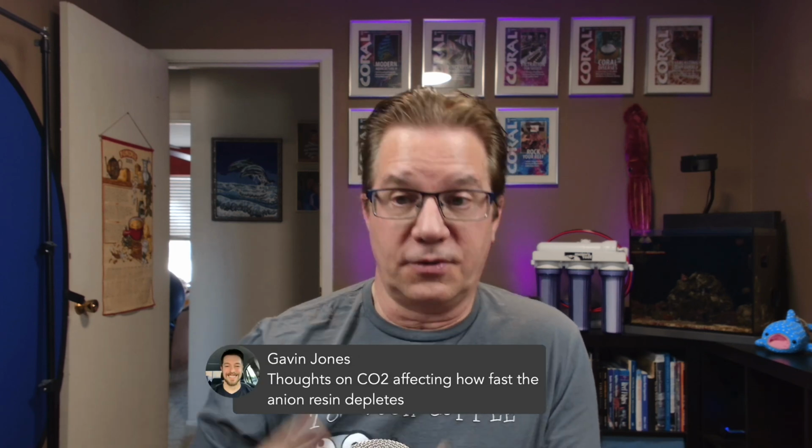Gavin says, any thoughts on CO2 affecting how fast the anion resin depletes? Okay, yes. How are we doing on time? We are running late. The CO2 in well water will destroy DI resin rapidly.